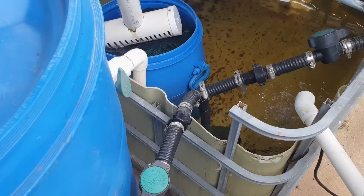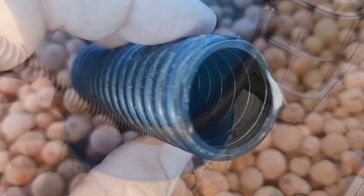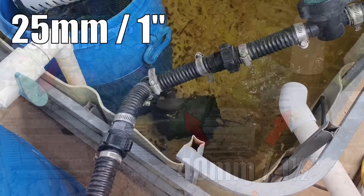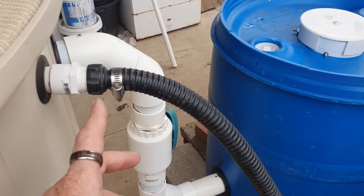With the pump, we also need to think about our hose work and pipe work. Hose work is fine as long as it's UV-stabilized, food grade, and has a fairly smooth bore — you can see ridges on the outside of this hose work here but it is fairly smooth on the inside. From the pump, I'd recommend you stick with the maximum size fitting built into the pump itself — this one here is a 25mm; I've had other pumps that go all the way up to 40mm or an inch and a half. Run that pipe work out as close as you can to the fish tank, then take it down in size at that point if you need to.